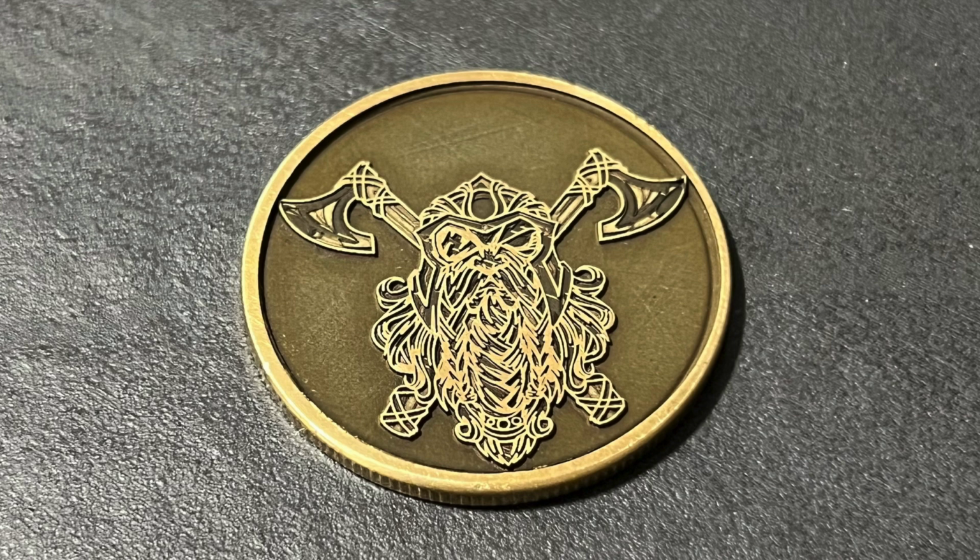The background does have some lines in it from the deep engrave. I probably would have spent a little bit of time making the background darker and maybe doing some more cleanup passes to get rid of those lines. Another thing is some of the details on the inside of the engraving, I might have gone layer by layer and set different speed, power, and kilohertz settings to those layers to kind of give them different colors so they're a little bit more easily distinguishable from one another.